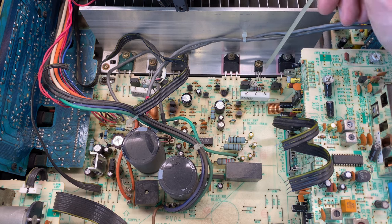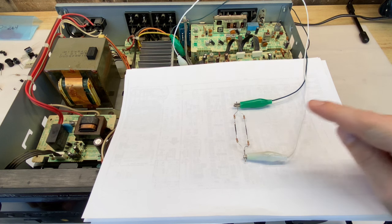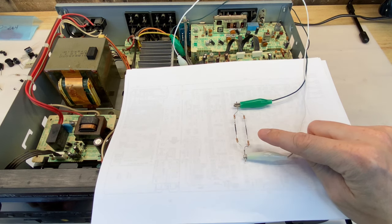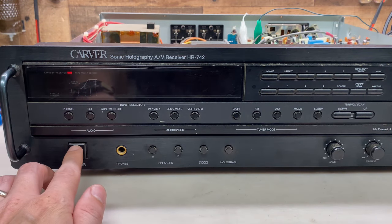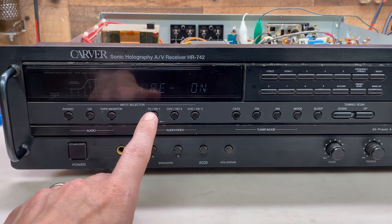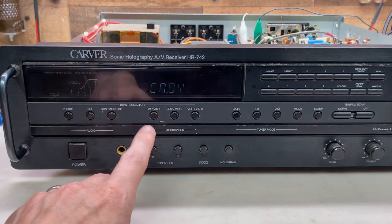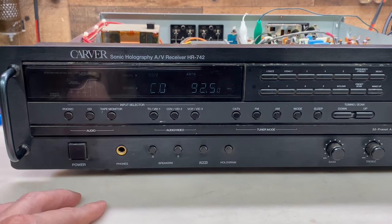Just for testing, I've replaced the open 68 ohm resistor with a 62 ohm resistor - that should be just fine. And I replaced the open 220 ohm one watt resistor with four 220 ohm quarter-watt resistors in a parallel/series configuration. Protection enable is still flashing, but it only flashes three times, then goes to ready and back to our input. I heard the relay engage, so we are out of protection mode. That's fantastic.